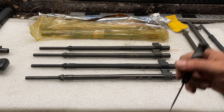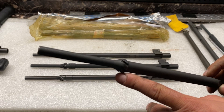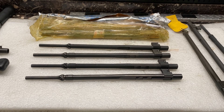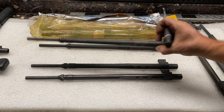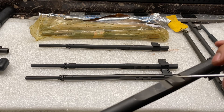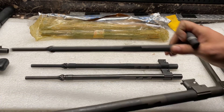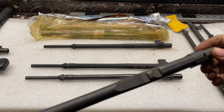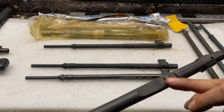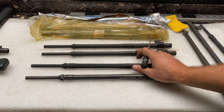The very first generation operating rod ever made had a different nose shape, but I don't have one for reference. The E3 operating rods are great. You can see this discoloration — that's heat treat. There was a lot of emphasis on heat treating the sear catches. It's not as prevalent on the standard one. This two-notch design is still a current issue unit.